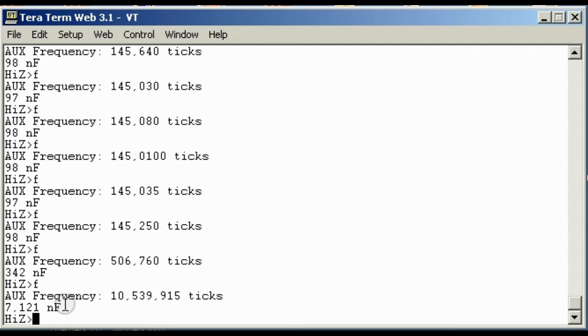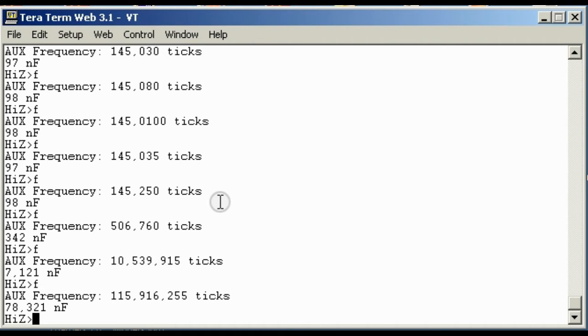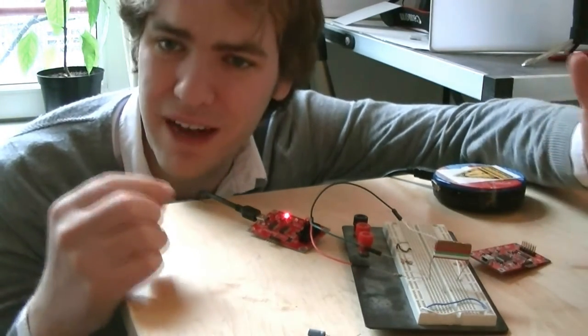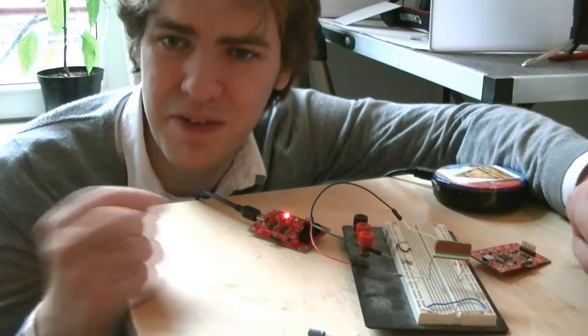Next we'll take a 100µF capacitor, and you'll see that it actually takes a really long time to charge and measure it. The way we get around this in a final design is by having several different values of charging resistors. If we start charging with the 100k resistor and it takes too long, we can move down to maybe a 50k or even a 10k resistor for a huge capacitor. That's how you measure a capacitor with the Bus Pirate — it's not super accurate, it's not going to win any awards, but we did learn how to do it using the hardware we already had available. The firmware is available on the forum — grab it if you'd like to try it out yourself.